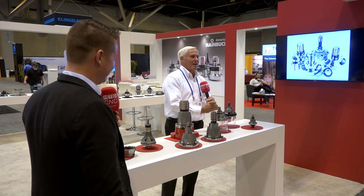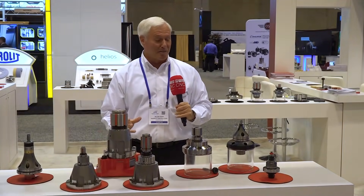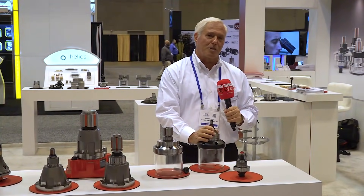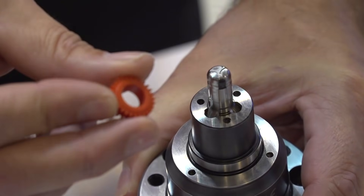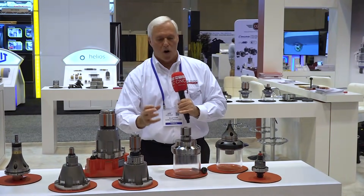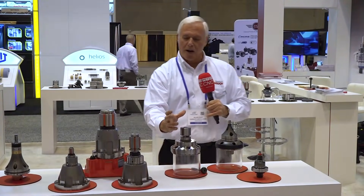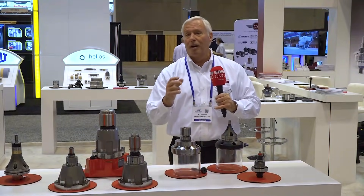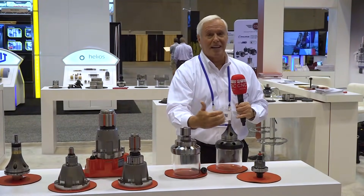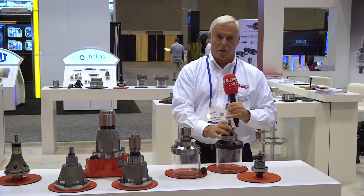To give you stronger clamping across different gear sizes — for smaller gears we have our Micro line, where we can get down to about five millimeters of an ID to do tiny gears. The reason it's different is because you can't use the same type of arbor and segmented ID collet or mandrel to clamp that small a diameter. Also, once you get to a smaller gear, the tools have to get even closer, so we need to provide clearance to get a grinding wheel or hobbing tool in there to do smaller gears.